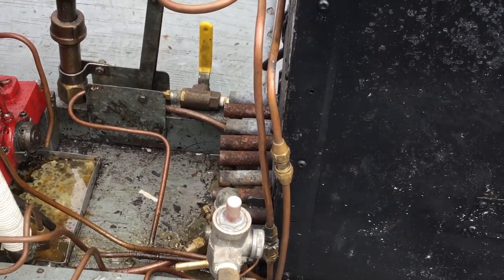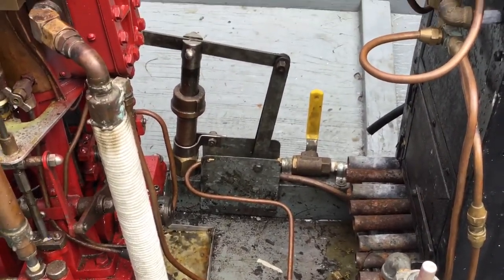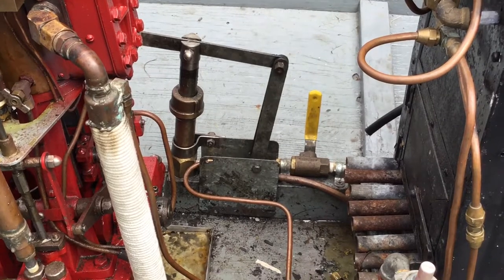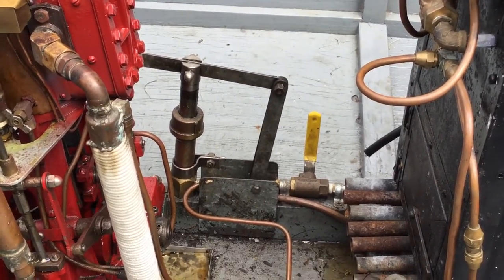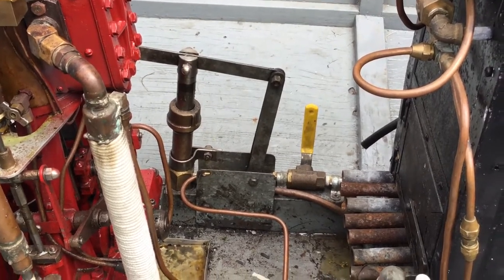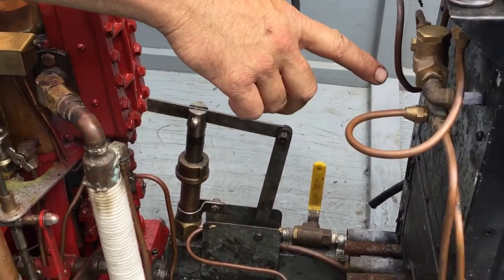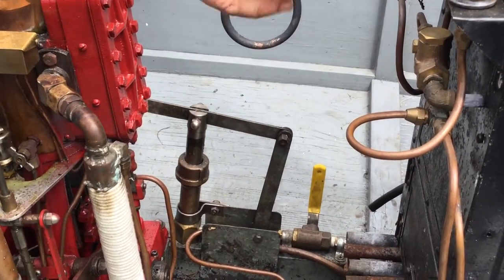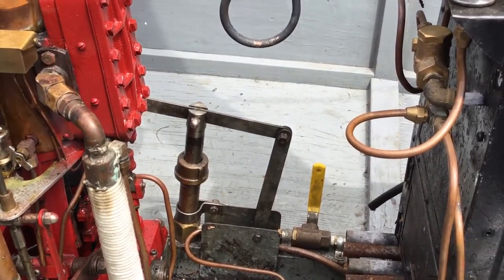There are steam tables online. Right now at 250, I think at 100–110 PSI it's like 300 to 350 degrees. You have to look at the steam tables. I ran steam locomotives, so I know roughly — I want between 250 and 300 degrees. We're still holding pressure in the feed water line, which is good. The checks are holding.